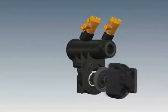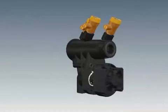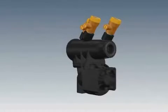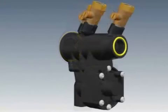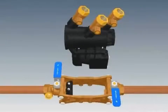Place the spring around the seat and the housing. Insert your cartridge assembly into the spring, then place the cover onto the cartridge assembly. Push the cover toward the housing and make sure the cartridge centers into the seat guide ring and the diaphragm is not pinched between the cover and the housing. Thread two screws into opposite holes by hand while holding the cover in place, then thread the remaining cover screws into place and tighten all screws evenly. Clean or replace the two O-rings that go at the ends of the housing.